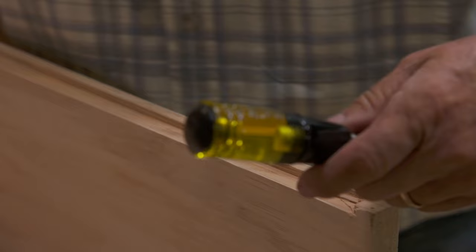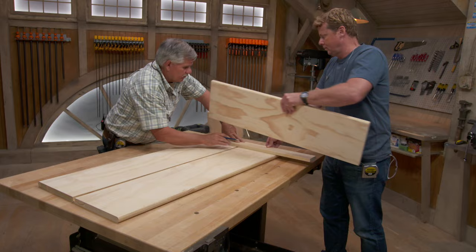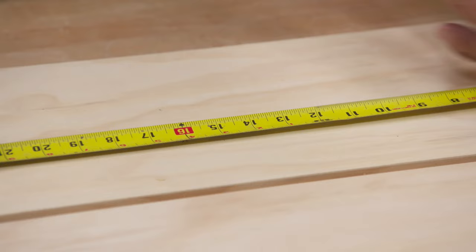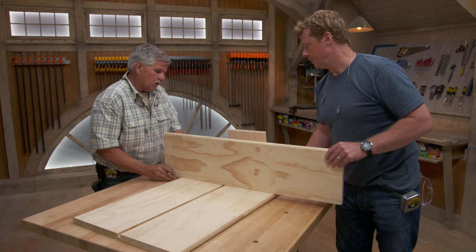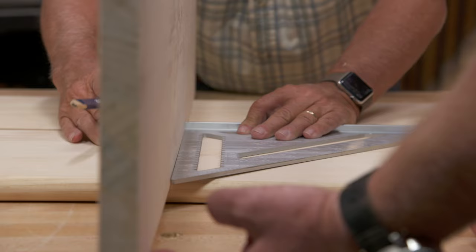Now we're ready to start laying out for our shelves. We have the inside facing us, back to back. We're going to have a toe kick, so we're going to keep that even with the bottom. We'll run a line, hold the shelf into position, push it down firmly, and mark the top of the shelf. Now we're ready to mark for the second shelf up — we want to make the distance between the top of one shelf and the bottom of the next 16 inches. So no adjustable shelves — these are all going to be fixed? Right. With the shelf on our 16-inch mark, I'm going to take my square, hold it on the side, slide it down until the shelf is square with the sides, and mark the top and bottom of our shelf.